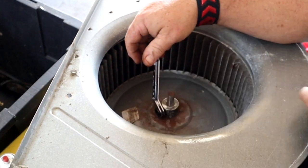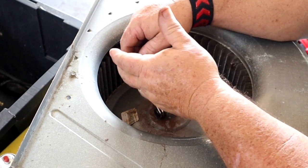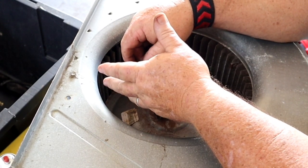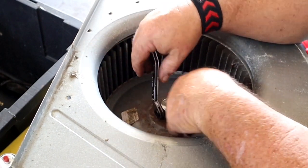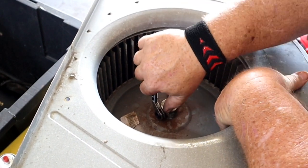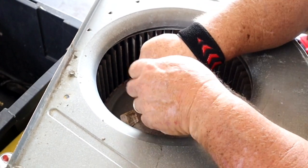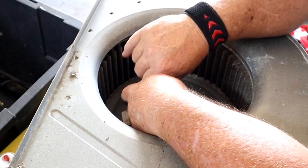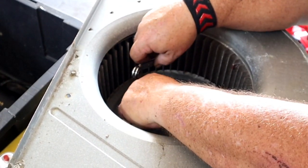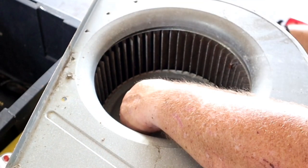There we go. I'm always surprised at how many HVAC techs don't know this. I mean, I've been working with guys, I'm like, just grab your pump down wrench and jam it on that screw. Oh, I didn't even know that fit. So we're gonna ratchet this. Am I tightening? Yeah, I'm tightening. Yeah, lefty loosey, Jason. Once you break it loose, it usually comes out by hand. Now I usually just take them all the way out.